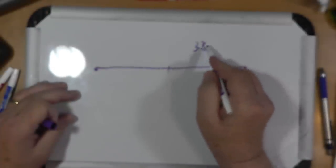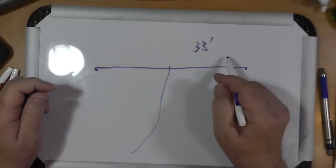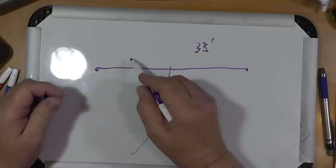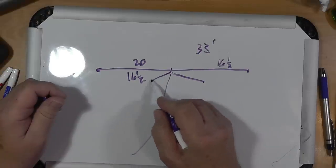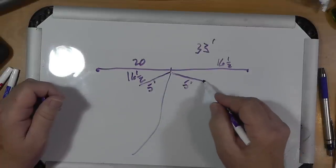Now let's suppose you want to make something yourself. I'll show you what to do. Make a 20-meter dipole — that's going to be 33 feet long, so 16 and a half feet on each side — tapped in the center with your coax. Just use house wire, whatever you want. Just attach right there to the same connectors your 6-meter dipole, which would be about 5 feet on each side. That's your 6-meter dipole.